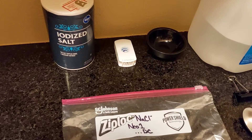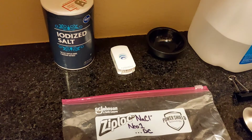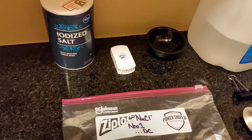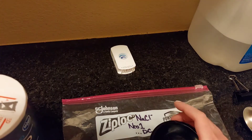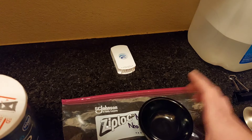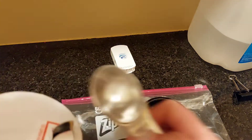We're going to go over one method on how to calibrate your NEO sensor for relative humidity. We use a salt, which produces a known relative humidity within certain temperature ranges once we add a little bit of distilled water to it. We do want to use distilled water — tap water has a lot of contaminants that can affect your readings.